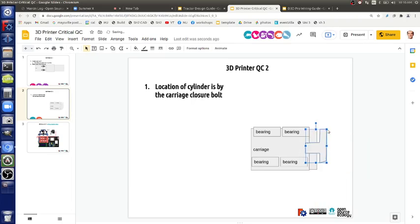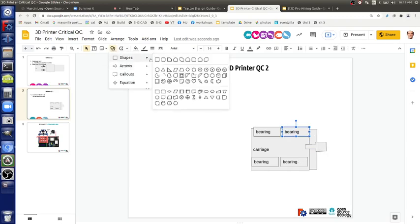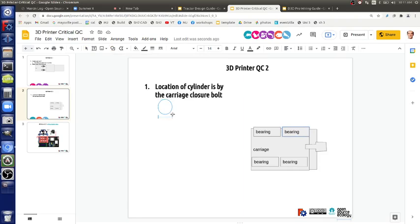That little bolt you've got, that's actually what it wants to be, more like this. It's the one with the hex, 5mm hex key, it's the M6 thread. So your little bolt that you have there, put the peg next to your belt peg, which from the profile looks like this here. That's your belt peg. Put it next to that bolt. That's step part one.